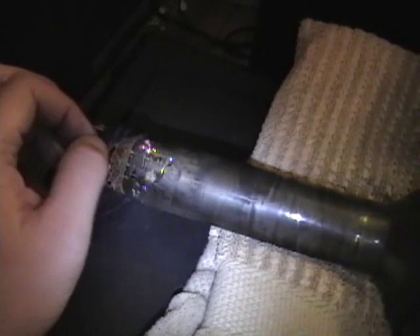From what I understand, to rebuild a tube you would take the base off, break the little glass seal to let air back into the tube, then use a hot wire to cut the neck open — you can see the seam right here. Take the neck off, remove all the metallic insides, replace them, put a new glass tube on, weld the glass back together, pump the air out, seal the end off, and put the base cap back on. It seems to have done a pretty good job with it.